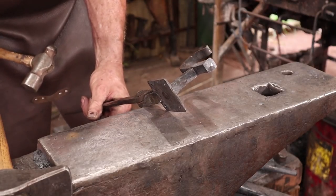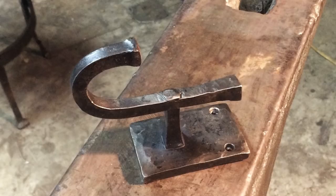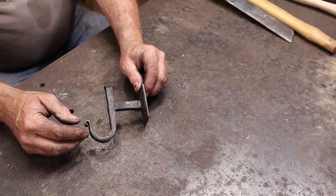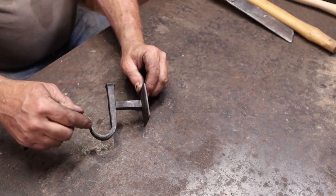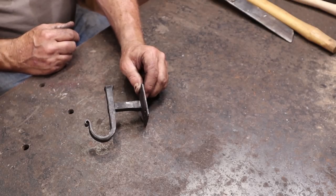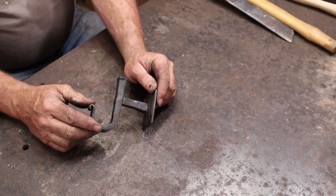In general, that's the idea for the hook. I think I would change a few things if I were to make more of these. Here's our finished hook based on Rudy's design. A few things about this one are different — Rudy's was square bar all the way to the end with an upset on both ends. I didn't have enough material in the bucket to do it that way, so we drew it out and made a taper. Looks good either way, but I think I still prefer the square bar that Rudy did first. I did take a little bit more time to square this up, which looks a lot better. I'd also make that standoff maybe a half inch shorter — it seems like it sticks out a little bit further than I'd like. I really like the way this tapered back plate ended up — that's a real nice effect, probably a bit of overkill for a hook of the week, but something I'll probably use again. By all means make time in your day to get out to your shop. Make something. Stay safe. Wear your safety glasses. We'll see you for the next one.